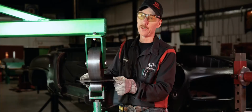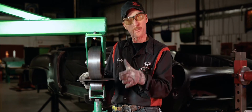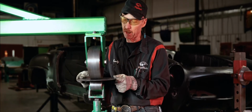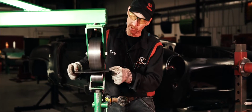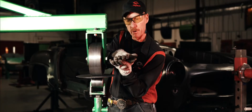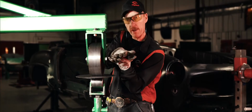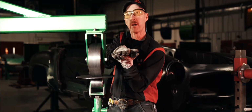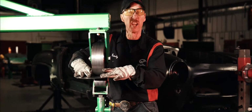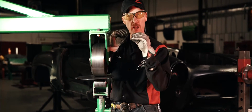Okay, now we're going to use the English wheel to start the process of changing the crystalline structure, or basically again moving our Legos. So as I move the English wheel back and forth, what it is doing is simply applying a little bit of pressure to our steel. I'm going to increase the tension on it, and as we run it, all that's happening between these two rollers is it is compressing the crystalline structure, forcing them to take out a larger area.